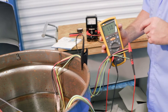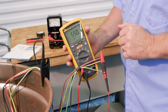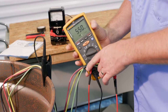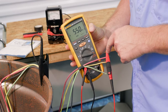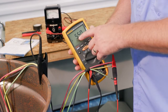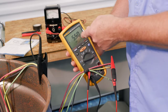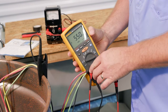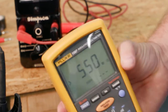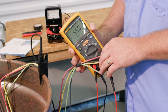Let's do the same test using an insulation resistance tester — the Fluke 1587 digital multimeter — for comparative purposes. We know the red is good, so let's see what it looks like. I'll press, hold, and release. It gives me a value: 550 million ohms, with a symbol indicating this meter is maxed at the 500-volt testing it's defaulted to. That means I have a very large resistance value between the red wire and the steel tank, indicating there is no connection — it's not grounded.